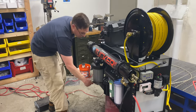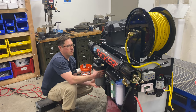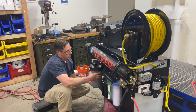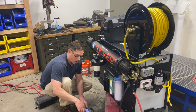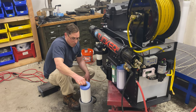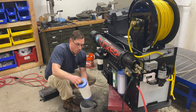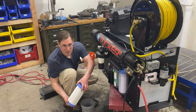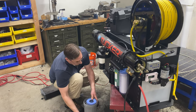And there's your four-and-a-half-inch wrench to gain access to your DI filter. Inside is a serviceable DI cartridge. You can have this on hand and ready to go. I wouldn't recommend buying any DI that you cannot use within six months — it does have a shelf life. You can get the entire cartridge or you can open the cartridge from the back end and fill it with mixed bed DI resin. You can get virgin mixed bed resin directly from us.